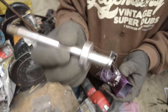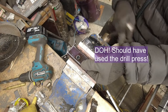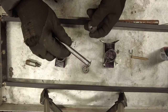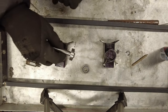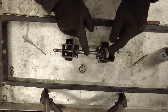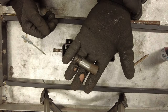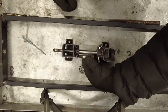Got our clip, our bearing on — that will eventually be sitting in the holder like so. We've got our bar, got the clip on the end there, put our bearing on, got a second groove cut in there for a second clip — that should retain the bearing in place. All I need now is some kind of counterweight on here so it spins around and causes the vibration. I've got this bit of off-cut steel which came from the barrel earlier — it's got a fair bit of weight to it — so I'm thinking of cleaning it up and welding it on the side there.